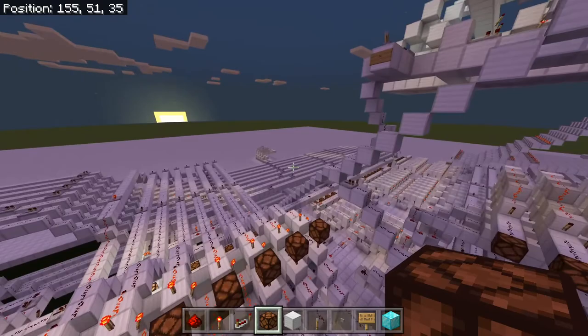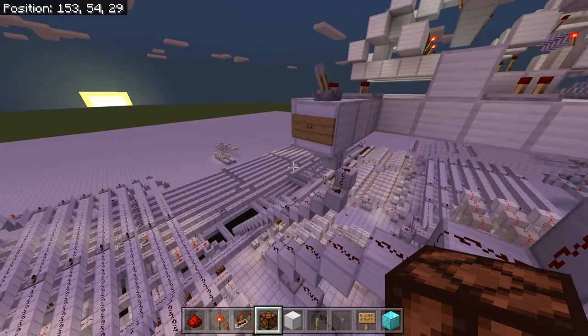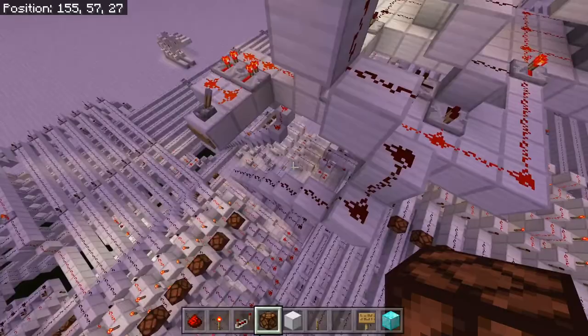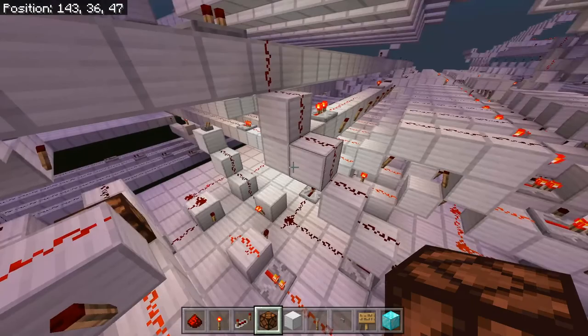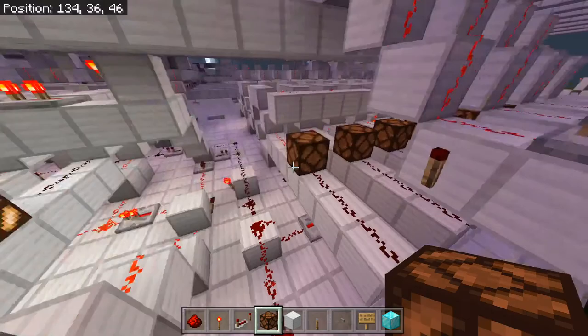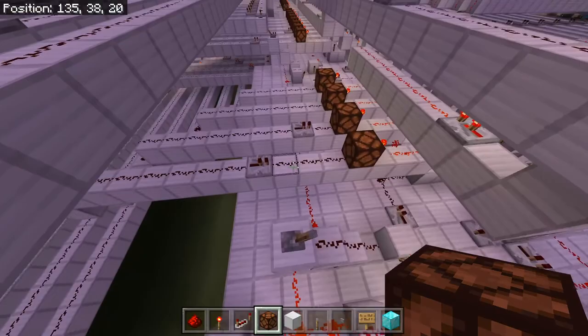our current program counter is zero, and if I just keep toggling the clock, we should see it increment, if I've done that right. Evidently haven't done this right, because I disabled the program counter. Okay, let me go and disable everything except the program counter for a minute. Disabled.